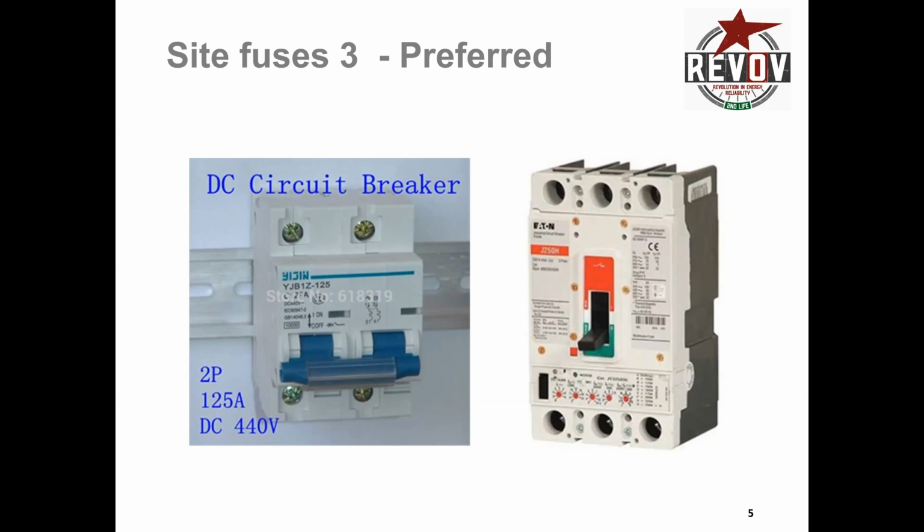So in other words, if you have 2 or 3 battery sets, don't attach each of the cables to these points and double them up on the bolt there, on the connection there. Rather put in a nice copper bus bar, and then put this switch in between the battery and the bus bar. Then you can disconnect each battery separately, and you have full protection, and your DC path is not going to be violated or shorted.